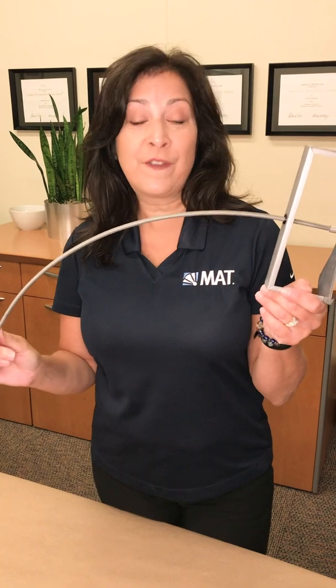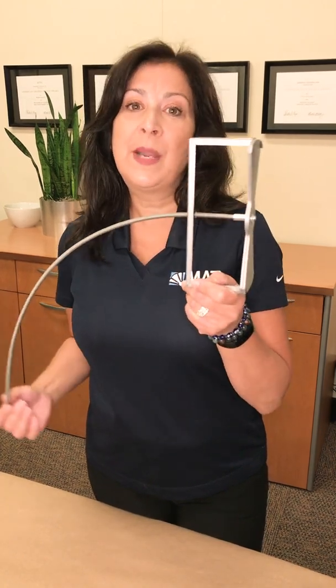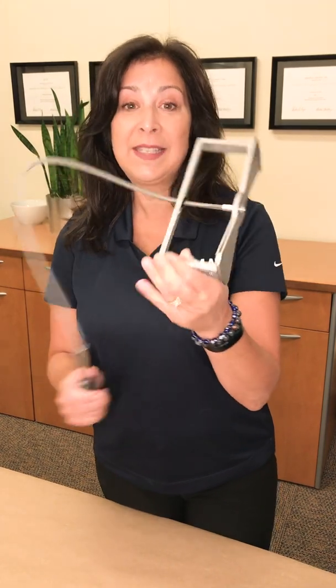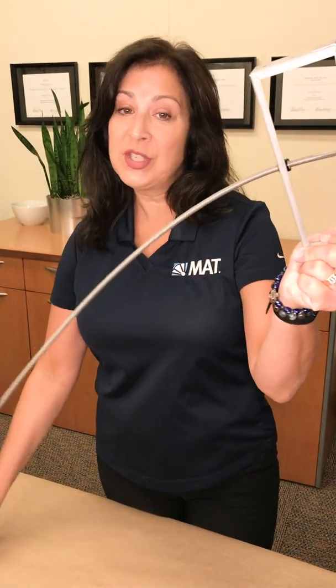If you're going to terminate from inside the airstream, this is our round damper. It has been specifically designed as one-piece construction for ease of installation. The damper comes in sizes of six inches up to 15 inches and ships with a two-foot cable. The damper gets installed in the branch takeoff, the cable comes down the face of the diffuser, a balancing technician grabs their standard hex nut driver, balances the damper, pushes the cable back up, and forgets about it.